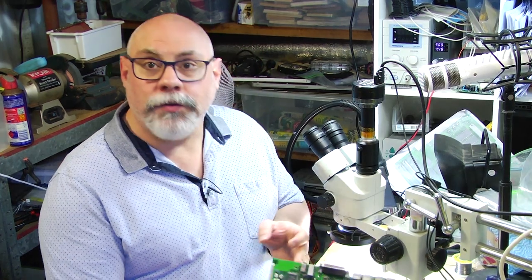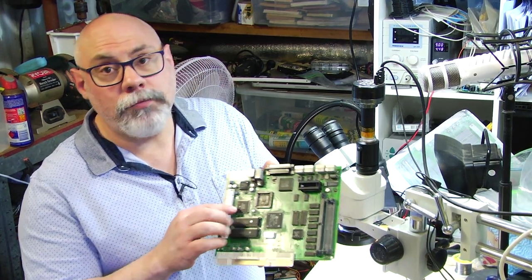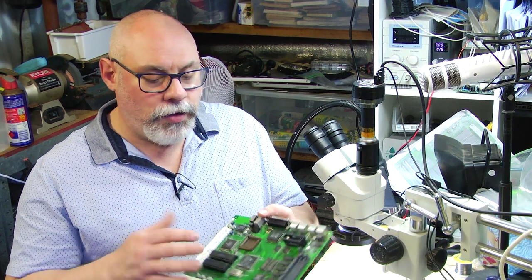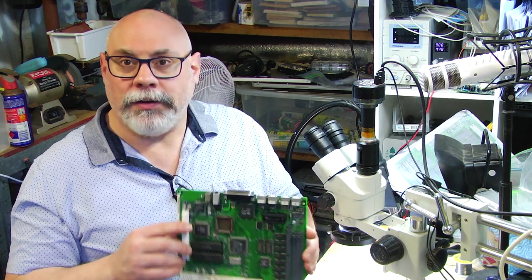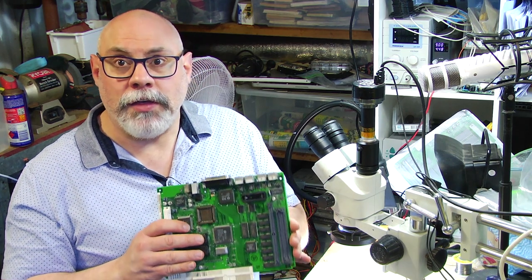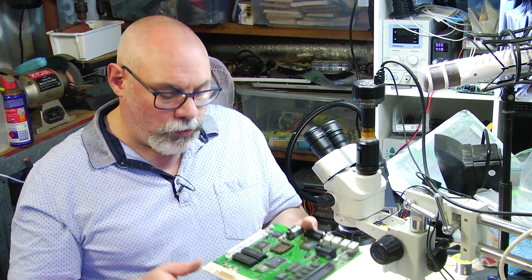And this is a very good example of one that has leaked terribly. You can actually see it all here. I think someone's actually had a go at cleaning it, which is fine because there are a lot of people on the web that are saying, if you get leakage on your logic board, just clean it. And look, that'll buy you a bit of time, but at the end of the day, that's sorting out the symptom, but not the cause of the problem. These electrolytic capacitors do need to be replaced.